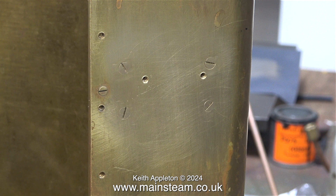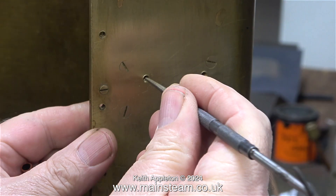Originally I drilled these holes using a one-eighth of an inch diameter drill in a Proxxon motor tool, because my larger drill at the time had a flat battery. Because these holes were one-eighth of an inch in diameter, I went into autopilot mode and threaded them 4BA. Now I'm correcting that problem by drilling the holes to tapping size for 2BA and tapping them 2BA.